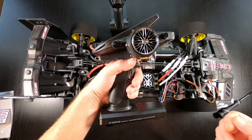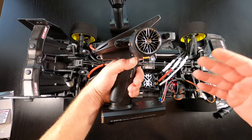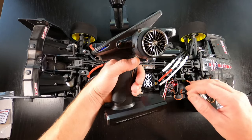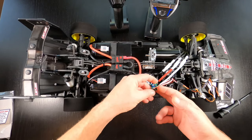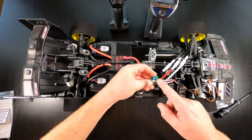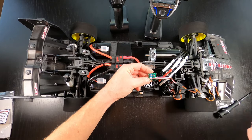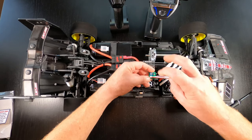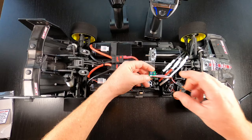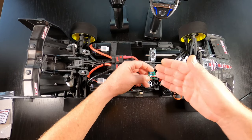When Perfect Pass is set all the way counterclockwise to the left, it's almost like Perfect Pass is not even there. Now we're recalibrated. We're going to turn off the system — every time we change settings on Perfect Pass we have to either disconnect or turn off so there's no power going to Perfect Pass. If you guys are using capacitors on your receivers or receiver packs, you have to make sure that your system is completely drained of power before you change settings or turn it back on.